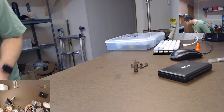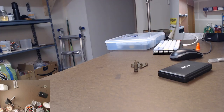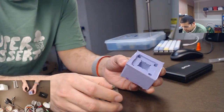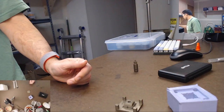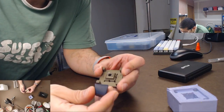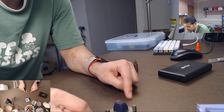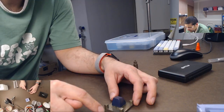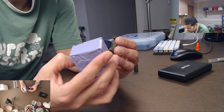And actually, I'll show you one of my molds that I used the synth on, one of my old Umu ones, and you can see what I'm talking about. Got a big old pile of them. Okay, here's one. So this is the one that I made the synth with. So what I did was the first half I did was I put a keycap on here, like so. And then I built a little box around it. And then I poured silicone over the top of this, right? In the box.